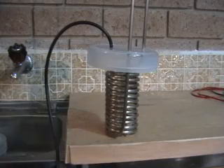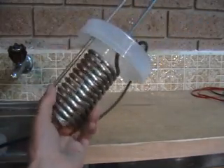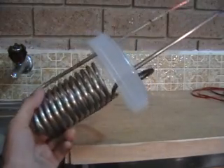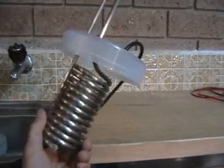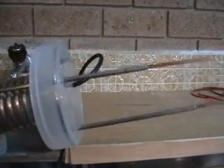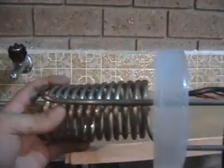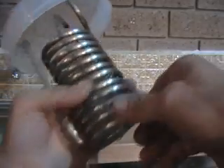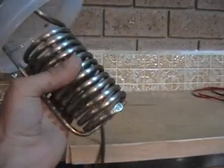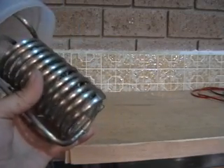This is the hydrogen cell that we built more recently. We did build one identical to this and tested it, getting some rough readings and outputs — mainly looking at temperature. Then we rebuilt the same cell again, but we inserted copper tubing through the full length and down through the windings of the stainless steel — we did this before we bent it. You also have to weld up one end of the stainless steel and make sure it's perfectly sealed, otherwise your water will turn a funny color as the copper corrodes from the inside out.